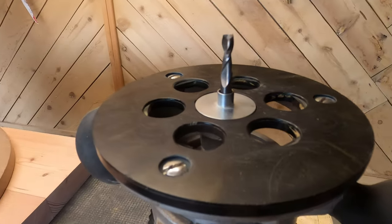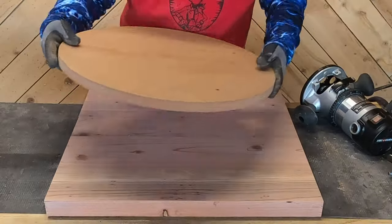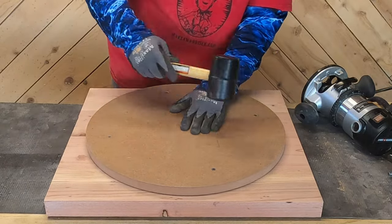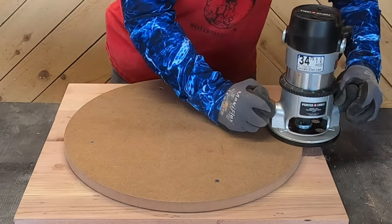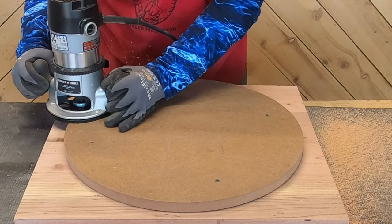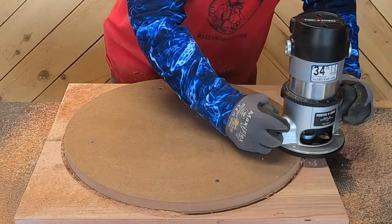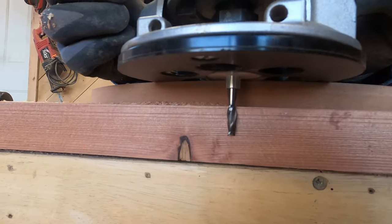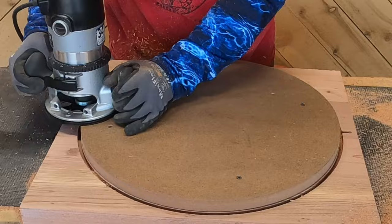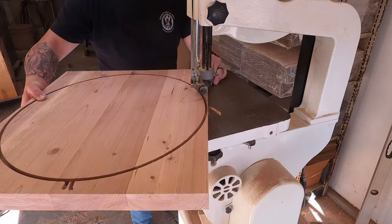There are a bunch of different ways to cut shapes. Dad's favorite way is to use a router and a template guide. We had this 18-inch circle template laying around from some other project. When you're doing this, you want to cut from the back side of your sign or table, because the template attaches to the board with four little screws that barely poke into the wood — the last thing you want is a finished project with four little holes in it. Because the pattern is three-quarter-inch MDF and our material is two-by, we couldn't cut all the way through, so Dad went through twice and then finished it up with the bandsaw and the freestanding disc sander.